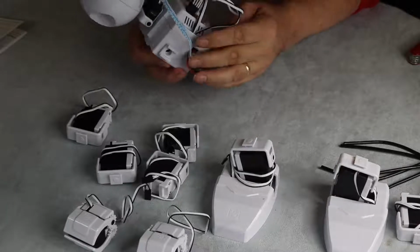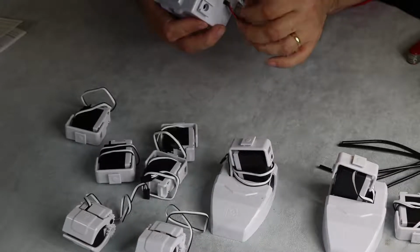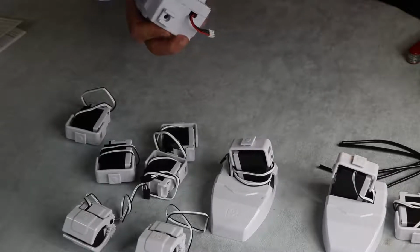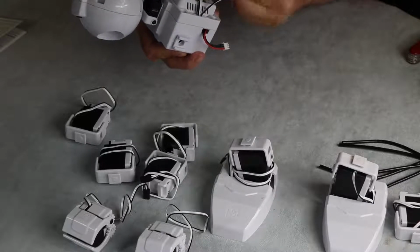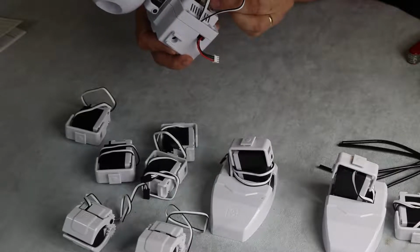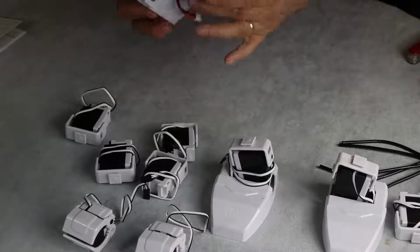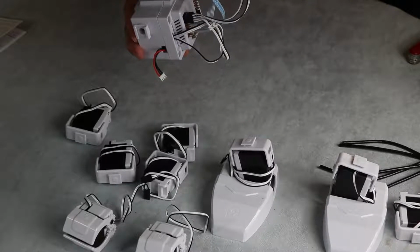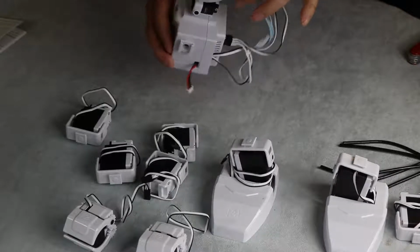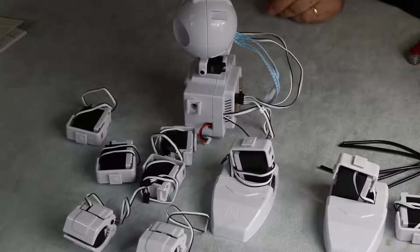So that's our camera port, and then the RGB eyes, which is this connector, need to go to one of the I2C ports, and the I2C ports are these 3 here. So we are just going to again make sure we're the right way around, take that, clip it in. So now we have our shoulder servos, our head servos, well, head and neck, and our camera and our eyes. So basically we have vision and shoulders connected. On to the next step.